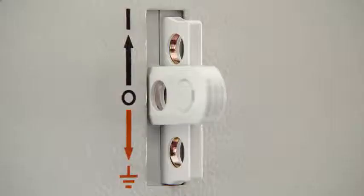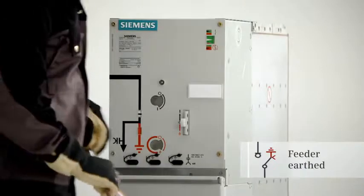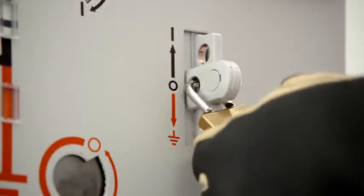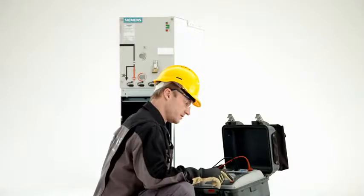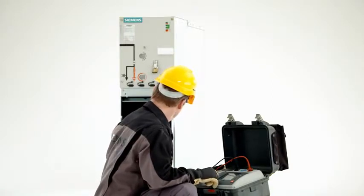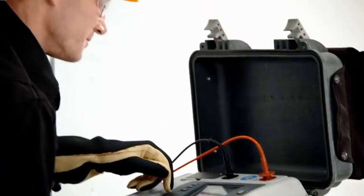To unlock the actuating opening for earthing, the control gate is pushed down. The feeder can then be earthed with the 3-position switch using the operating lever. Thanks to the design, adjacent live parts are already covered by the switchgear enclosure or protected with barriers. Only now, when the feeder is isolated and earthed, is the cable compartment accessible. If the cable compartment has been opened, for example for testing the cable, the interlocking prevents the feeder from being energized.